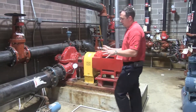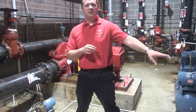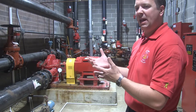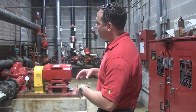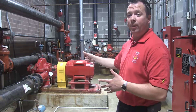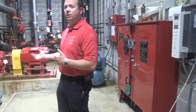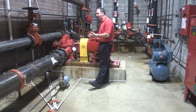If you have a fire pump, you will also have a jockey pump. A fire pump is monitored by a fire pump controller, which monitors pressure and will engage if pressure reaches a certain low point. The jockey pump keeps the pressure up to where it's supposed to be so the fire pump controller never thinks pressure is low enough to need water. However, the jockey pump is also undersized so that if a sprinkler head did go off and we really needed the fire pump to run, the jockey pump can't keep up with the pressure drop — eventually pressure falls low enough that the fire pump senses it needs to run. The jockey pump's one and only job is to keep pressure inflated so the fire pump never runs unless it absolutely needs to.